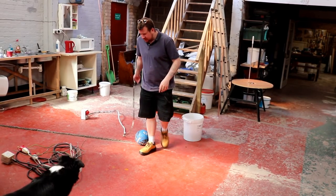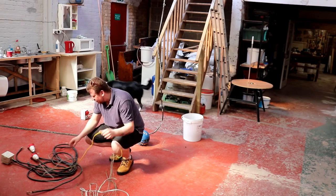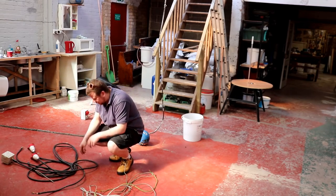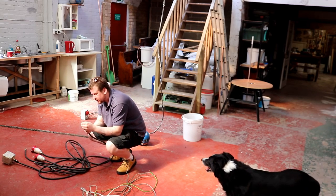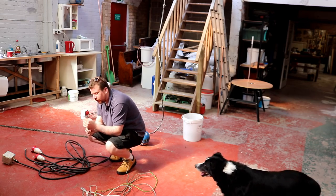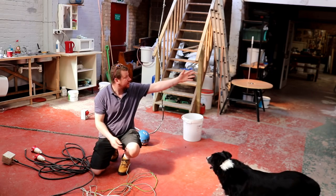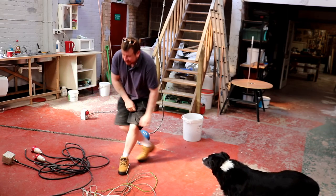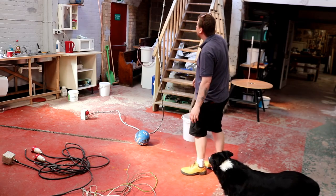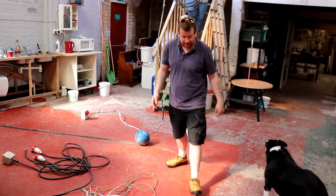Welcome along folks. Today the plan is to drag all the electrical cable that I've salvaged. When we moved in there were lots of three-phase power outlets running all over the place and we took them down and put them upstairs. That's four core. So I'm going to lay them all out today and see if we've got enough to drag some power from the consumer unit over there to this side so we can plug these elements in. I think we'll be able to pull it across to power three elements and then we can just run the pumps off the single-phase ring main. That'll be the plan.